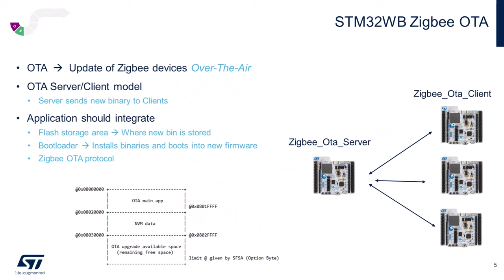For this application, you'll need two STM32WB55 Nucleo boards. Each board should be loaded with the wireless coprocessor binary as recommended in the readme documents provided with the application files. On the ZigBee OTA server coordinator board, a binary image must be loaded at address 0x08030000 before starting the process. In this example, we'll be using the ZigBee on-off client router OTA application as the update. Once these prerequisites are met, you can proceed to start the coordinator and router boards. The board configured as the ZigBee router will automatically attach itself to the network created by the coordinator, allowing it to be ready to receive OTA updates seamlessly.